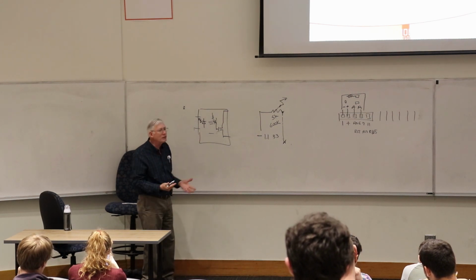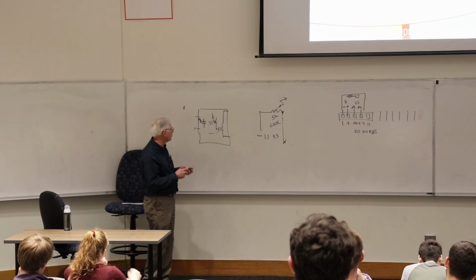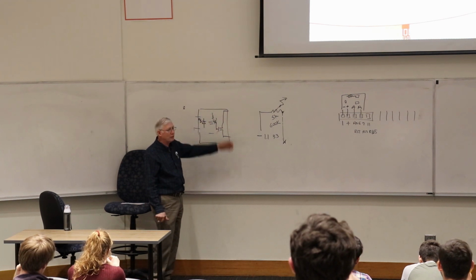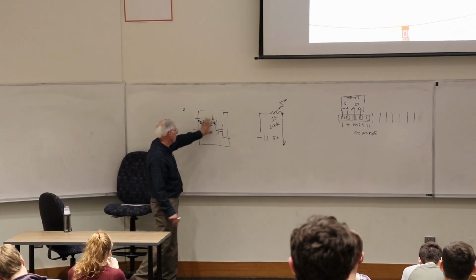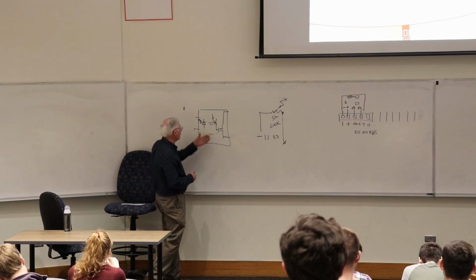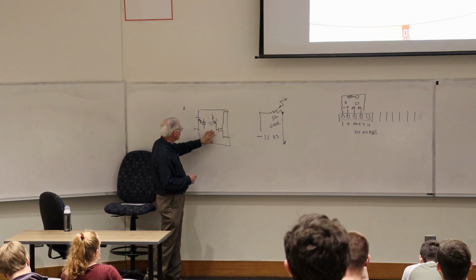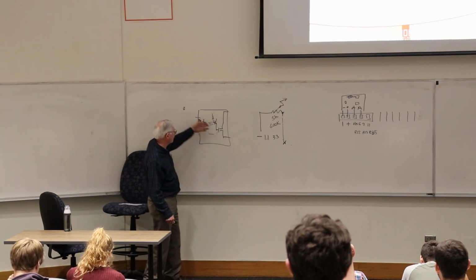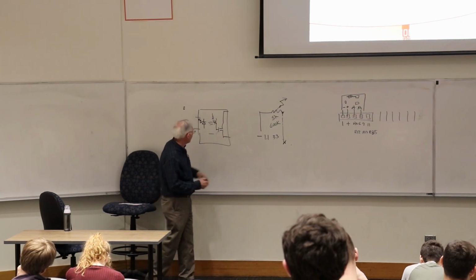That provides you a tremendous amount of isolation. To get a spark to fly across there, you're in the thousands of volts now to bridge that. So your opto-isolators typically give you maybe 10,000, 20,000 volts of protection here, which is really nice. Maybe not that much, but it's quite a bit. And it might even be in a vacuum, all the better, where it can't ionize something and jump across. And it's usually all sealed up, so all you see are the leads coming out. And this is a very nice thing.